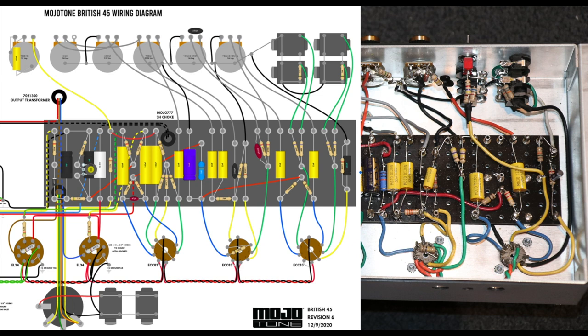The other things you'll need to change is the tone stack values. Right, so in a JTM45, I think this is a 220 picofarad and maybe a 56K here. Right, you want stock Plexi values, 33K slope resistor here and a 500 picofarad mica cap here, right? So this is your treble capacitor, okay? And from there, you're off into the tone stack.